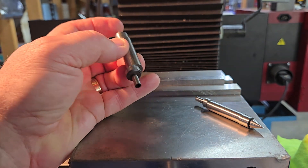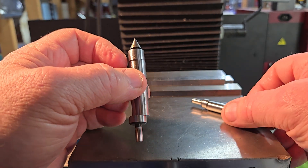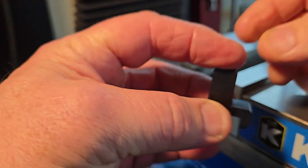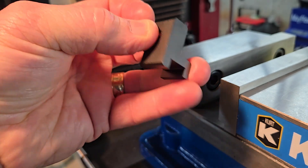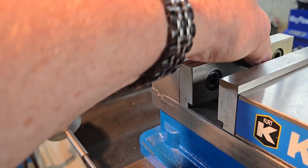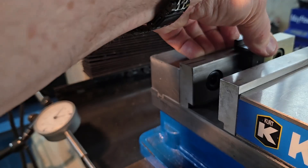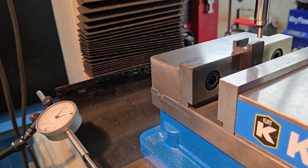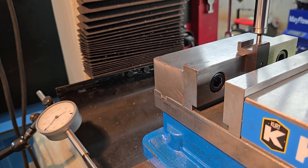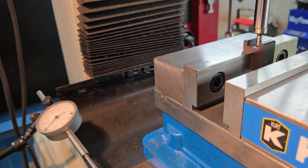Here's an example of both the half inch and the three eighths in a side-by-side comparison. Do you remember that chair I mentioned earlier? This is what they refer to as a chair — just a nickname, but you can see the resemblance. It kind of looks like a chair. What this is for is to help you find the edge of a work piece, and it's just another way to do it. It's magnetized — that's a magnet on the inside. So I'm just going to find the edge of my vise jaw, dropping the edge finder down into this little edge finder helper here.